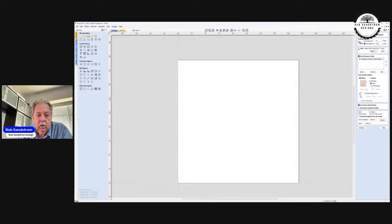Now, you had mentioned that you entered it as an engraving tool when we were talking, Chris. And yeah, you can do that, but it's going to kind of throw off the design if you're trying to get sharp points out of your V-bit or out of your tapered ball nose. But if you are using a tapered ball nose with a flat tip, it's probably more accurate to do what you did. The problem is you won't be able to see the sharp stars and it won't get as deep as it would otherwise, if that makes sense.